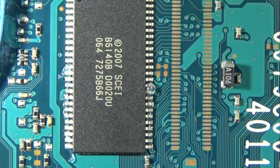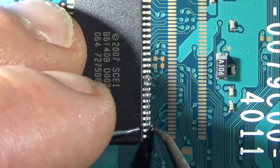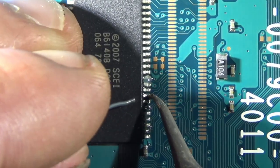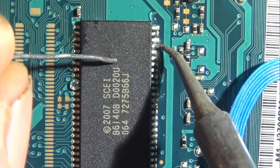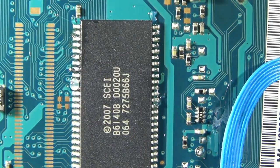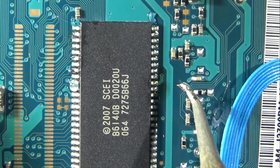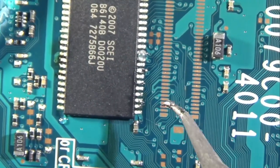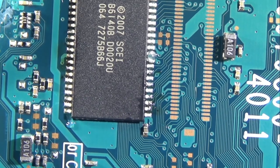Now we're moving on to the BIOS wiring. This might be difficult for a newcomer, but it's significantly easier than what we already did with the CD control wires. This should be a walk in the park by comparison — it's just a couple of pins, the pins are much thicker, and the spacing is more forgiving. We just tin up the ones we want to solder to. It helps to keep track if you've got a finer tip like this and just tin the ones you're going to — makes it a little easier to eyeball.